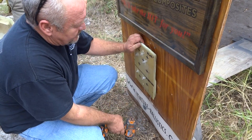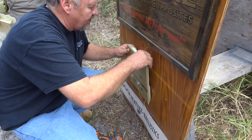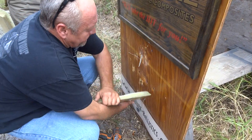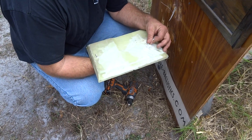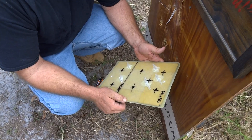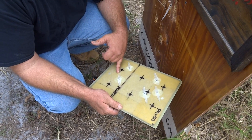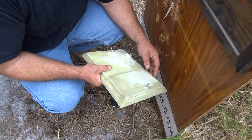This one's a combo — aramid in. It broke them off. We've got some back face but no penetration. This is a phenolic with a 50-ply on top. And this is a phenolic with a 50-ply and a 12-layer soft ply on the bottom, and there's much less back face on that.